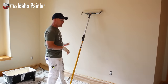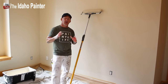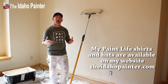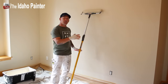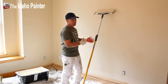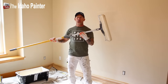We're working along on our cut-ins and moving to step number eight: rolling the second coat on the walls. There are different ways to do this depending on how many people you have and whether you have wood trim or painted trim you're caulking. On this room, we have wood trim, we're not caulking, just tape next to the trim — so we do our cut-ins and then roll the second coat. If you want to roll walls fast, use an 18-inch roller.